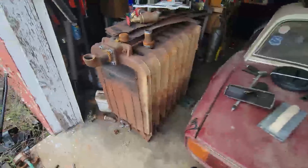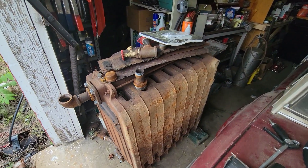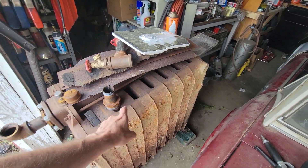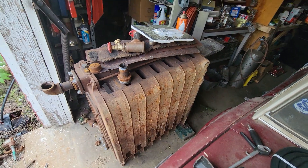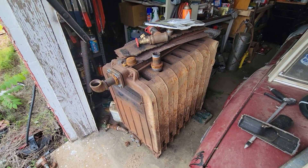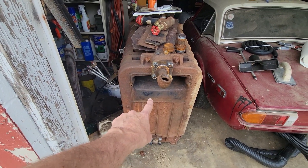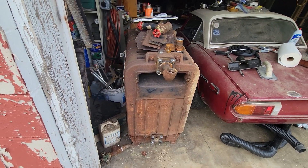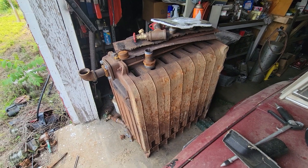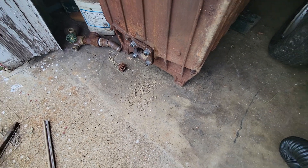Also got to give you an update on the wood boiler, which is watertight — I tested it. I'm accumulating replacement insulation panels. These are all open to the firebox, so there's insulation and then steel plates that go on top to seal it, and then a sheet metal jacket goes around the whole thing and the smoke hood bolts onto the back. We had it tilted because we were flushing it out, filling it with water, and got all kinds of mud and sediment out from the hydro test.